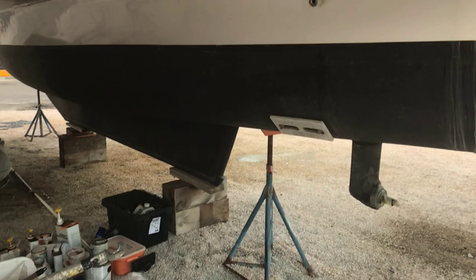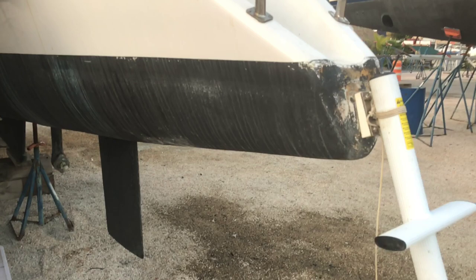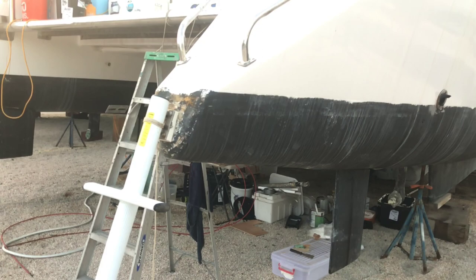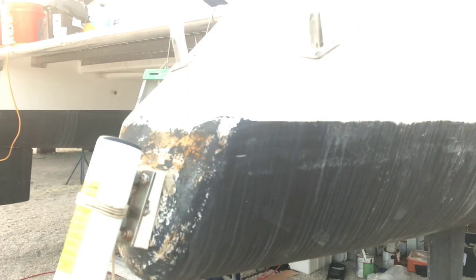I'm sure it'll be pretty good. This boat has the bits that I didn't have on my other Flica, and that is the extended transoms with the transom steps. It adds about 3 feet, but cleans up the exit of the water. So this boat's a full 12 meters, and we should get a little extra speed and definitely less hobby horsing. It has these great dive ladders. They unclip, just mount onto a block and slide out, and then get put up on the back deck into a couple of holders.